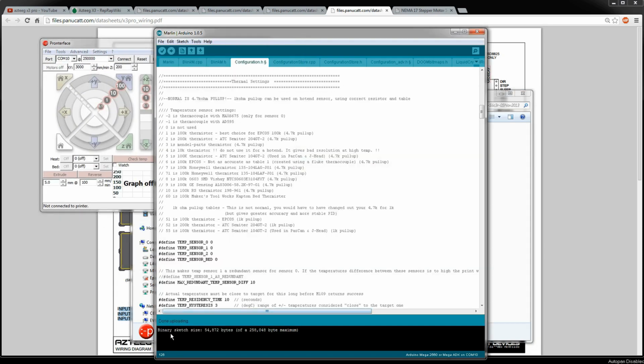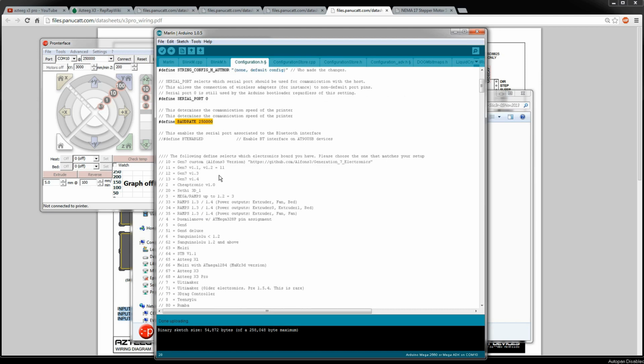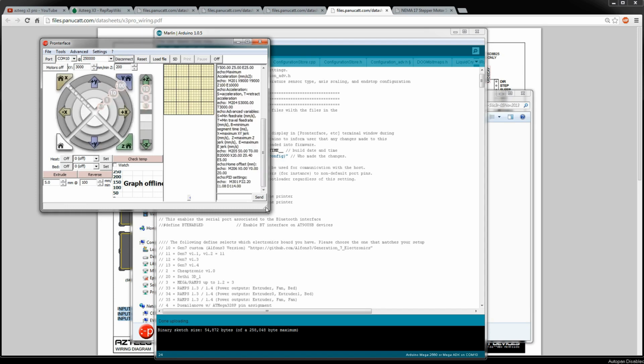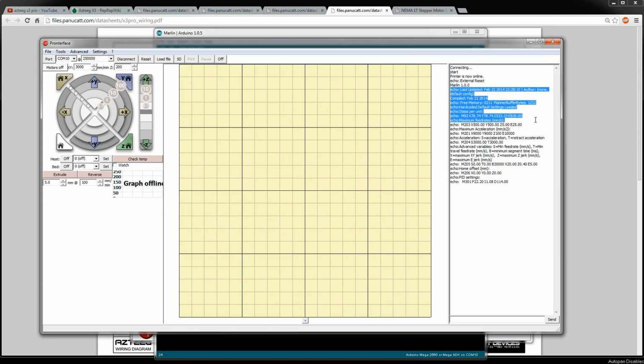So once completed, which looks like we're done, if you go back to the top, you'll recall that we have set the baud rate to 250 kbps, and normal serial port. So that was COM10 from before, and this defaults to 115.2, so we'll knock this up to 250 rather. So connect, and we are connected here. So you can see some status in this area here. Free memory, some feed rates, things like that, home offsets, PID settings. So it doesn't look like we have any errors, nothing going on. So before I had an error here, that's what fixing the thermocouple setting did, the RTD setting.